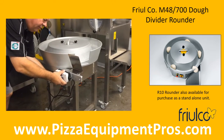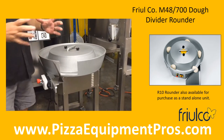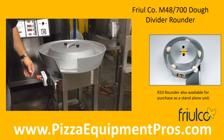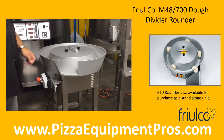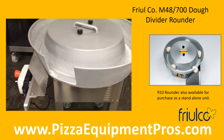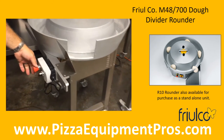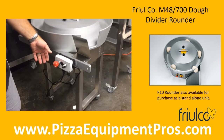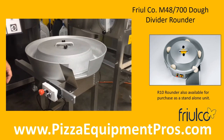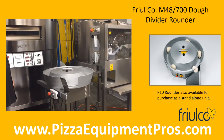Some people prefer the front, some people prefer the back. We just tighten the knobs to hold it in place, and at this point we can take two dough balls and put them together, or finish our first set a second time through the machine. We simply turn the machine on and drop our dough balls into the rounder and they make their way out the front. Should there be a reason to stop the machine in a hurry, you have the panic button — it turns one quarter turn to release and acts as your on and off. Effectively, you now have the ability to divide and round or round only with the new M48700 system by Friul.